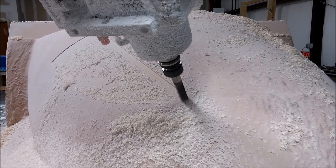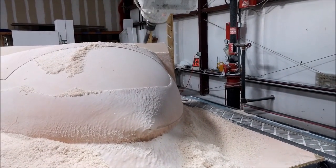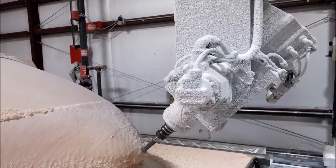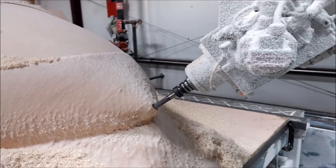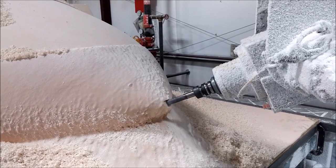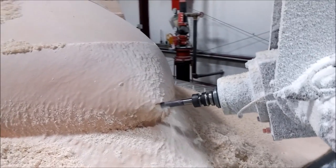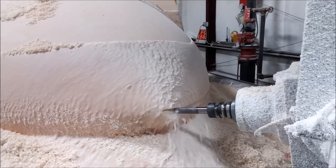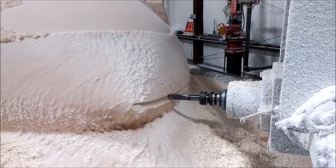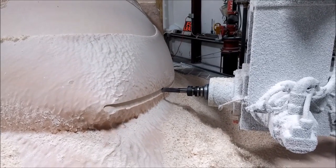Here it's starting the cut on the left-hand side, just above where the joggle is — where the upper and lower skins will mate together. The mill comes in pretty quick sometimes, but I'm getting confident it knows what it's doing. I've yet to have it come blazing in and make a big mess. Usually when it makes a mess it's in the middle of something and there's something weird in the toolpath, but I'm getting better at recognizing and avoiding those by adjusting the toolpath.